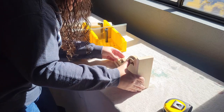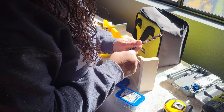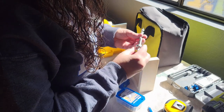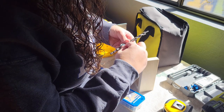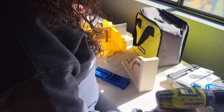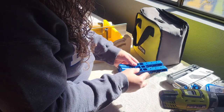I'm going to attach the two pieces of wood for each corbel together using my pocket hole jig — this is my favorite new tool, it's so handy and pretty easy to use. I did this all yesterday with the two-by-fours I decided not to use, so I'm setting my depths to three-quarters of an inch to match the thickness of my wood. I'm using one-and-a-quarter-inch screws for harder woods, and I noticed right on the box it tells you what length of screw is right for the thickness of your wood, which was super helpful.